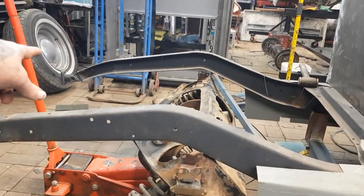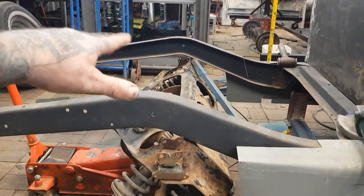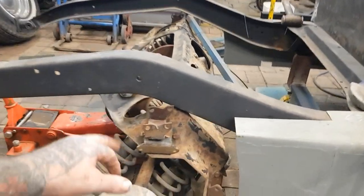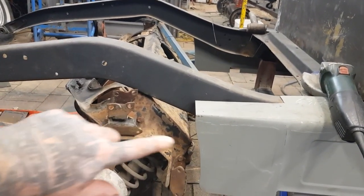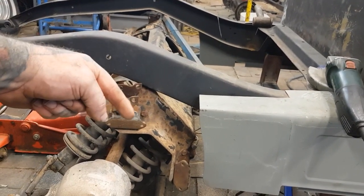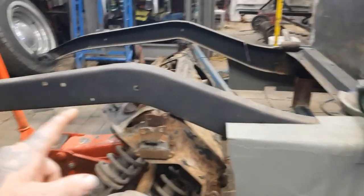We make sure we've got a brace in the back. We can then cut that diagonal out, notch it in, play with it, tack it, weld it out. And basically, if we cut all this correctly, we should be able to do all that. And then once I've cut all this out, I'll probably plate the actual cradle at the end. Then we'll stick it in and then we'll weld it. That's the plan on the rear end, I think.